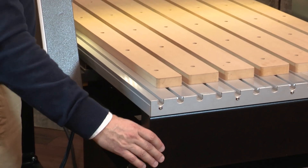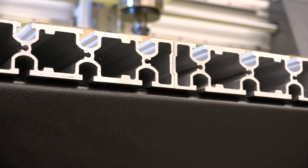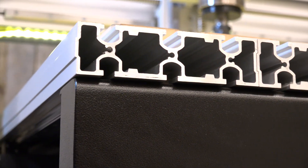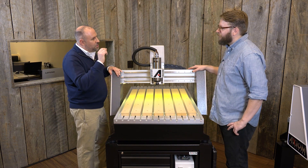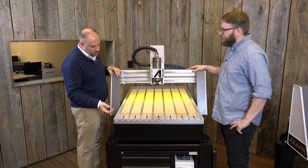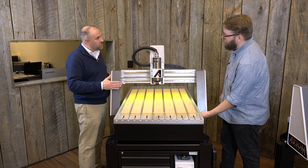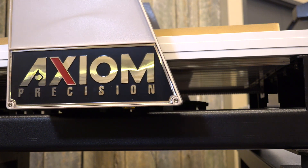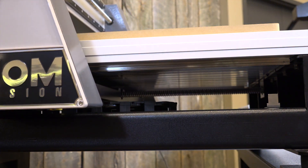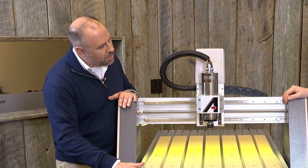The table on our machine is suspended over this massive steel frame. It's an extruded aluminum 40-millimeter thick massive aluminum extrusion — not that thick just because it looks cool, although it does. It's that thick because you could park a truck on it. It's extremely rigid, and rigid enough that it allows us to take our prismatic guides, which we utilize to suspend the gantry on the Y-axis, and hang them from the bottom of the table. They're out of harm's way, out of the path of dust.